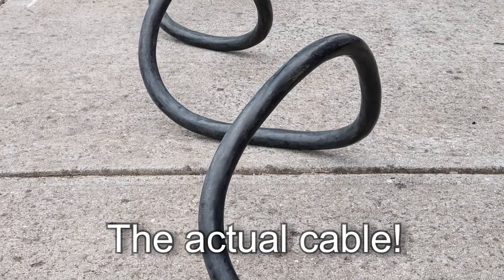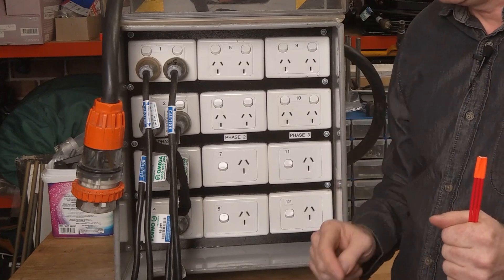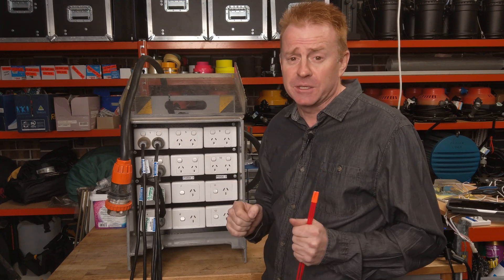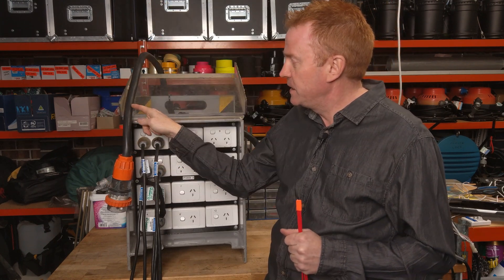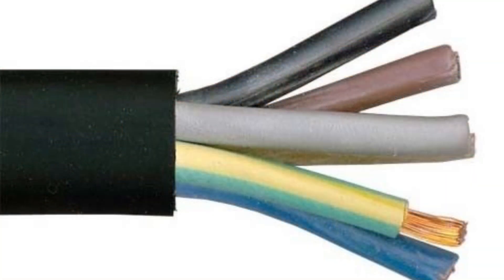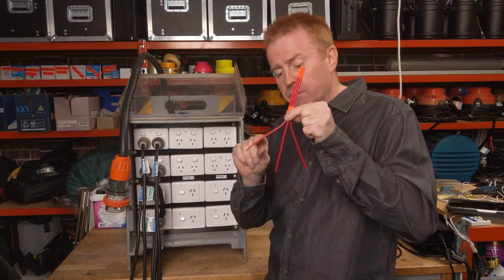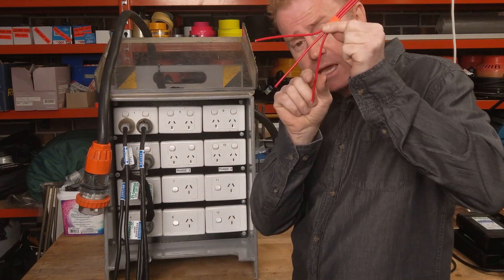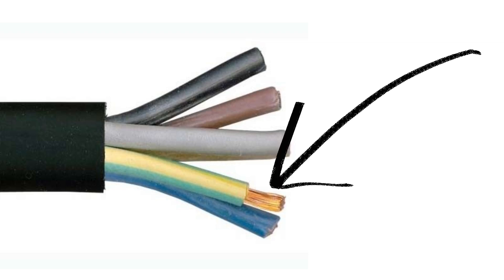So what caused the cable to coil up? They had all of the power running on one single phase — phase two and phase three had nothing on them, so the box was completely out of balance. This big cable has five smaller cables inside it. The cores that supply power to the outlets — the actives — are one cable for phase one, one for phase two, and one for phase three. These internal cores are made out of metal, which conducts the electricity.